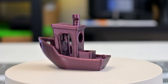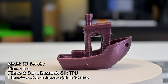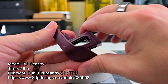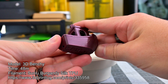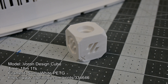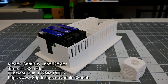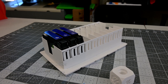The S1 Pro handles other material types as well. The Sunlu Silk TPU printed just fine using the TPU profile in the FL Sun Slicer — the top surfaces look great and there is minimal stringing, which is difficult to achieve with flexible TPU. PETG also works great — the test cube is smooth and consistent, and I've been using PETG to print out Gridfinity tool holders with thin walls where PETG was perfect.